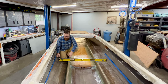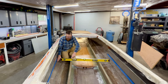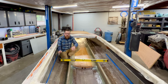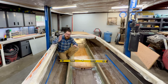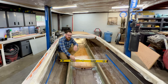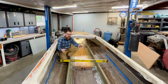In addition, I'm going to run some lateral supports that extend out and end right before the angle for the gas tank. They're going to run on the floor at the same height as the top of the stringers. What I'm trying to achieve is that if there's any movement on the outside of the boat pushing up on the floor and wanting to twist, it's going to take that force, push it into the stringer, and the stringers will be tied together at the center support. I'm just trying to increase the rigidity of the boat and stiffen everything up.